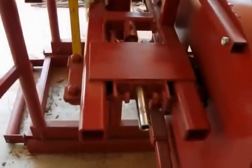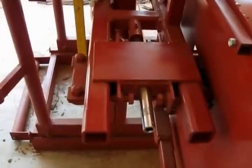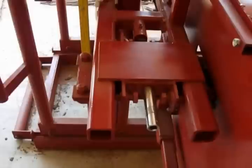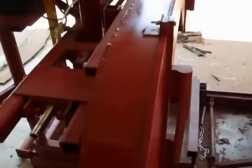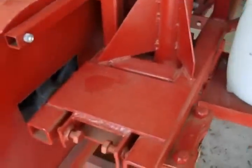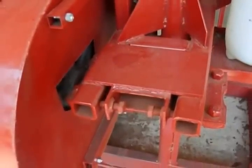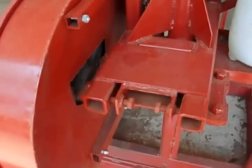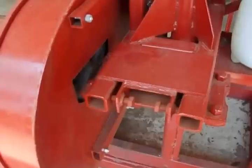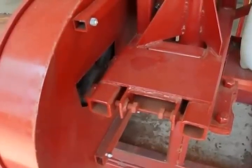I have four bolts to adjust the wheel — they're five eighths inch grade eight bolts that feed through lock nuts, metal crimped lock nuts welded to a quarter inch plate, so they're real steady. I've got the wheel adjusted so it is perfectly parallel with the drive wheel. On the other side I only have three bolts because one goes through the front to center it. I wound up with a 32nd of an inch — actually a 16th of an inch — toe out over a 20 inch wheel, which helps make sure the bandsaw blade is up against the guides.